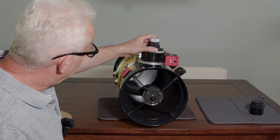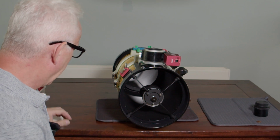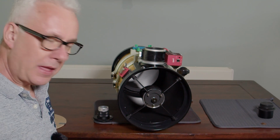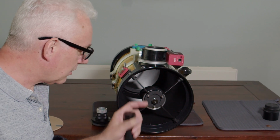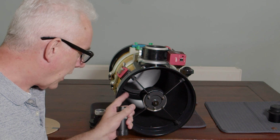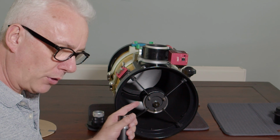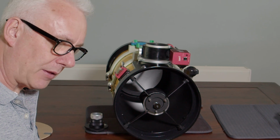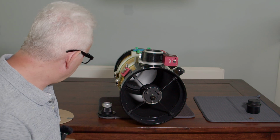Okay, the time has come to build up the full Takahashi collimation tool. And if it hasn't become apparent by now to you, I think another mistake people make with these telescopes, so I'll make this explicit right now. You cannot collimate these telescopes under a night sky with a star, because this is not, I hope you realise by now, your typical Newton telescope. And I'm not talking about the hyperbolic mirrors, the hyperbolic primary mirror. What I'm talking about is the fact that because this is an offset design, your donuts, your unfocused stars will always look slightly wrong. And if you try to make them concentric under the night sky, what you've actually done is decollimated your telescope. You've got to use the Takahashi tools.